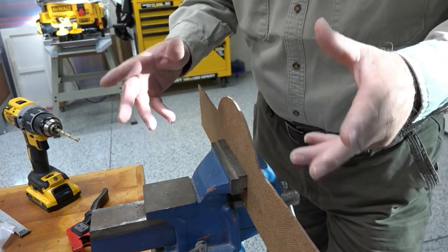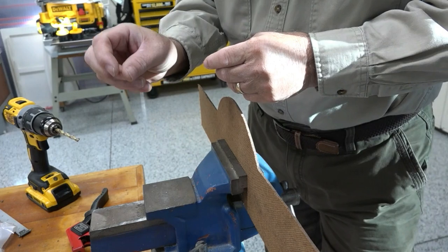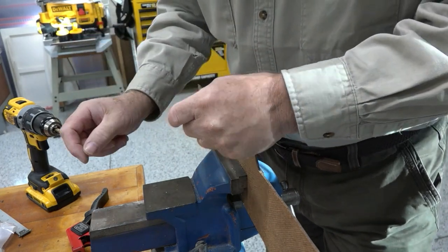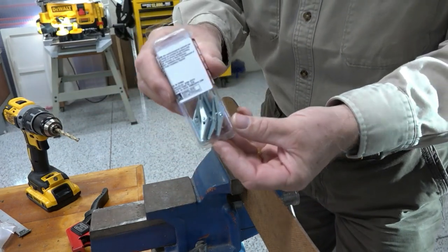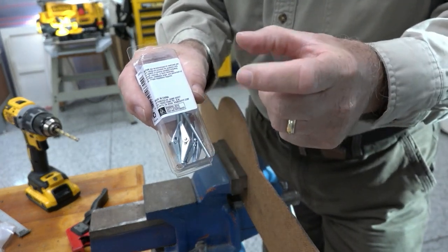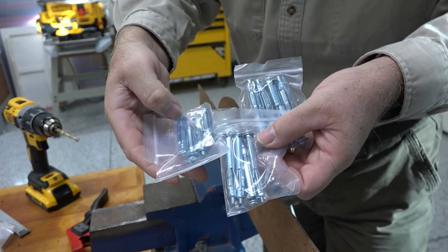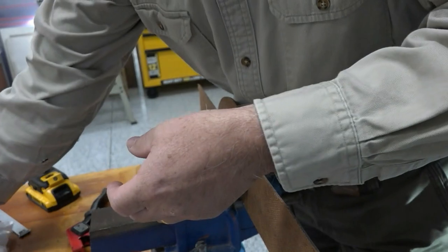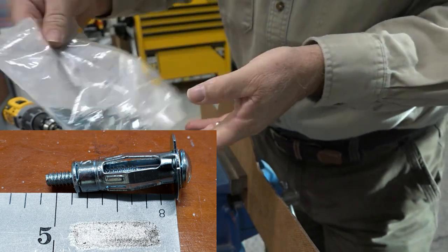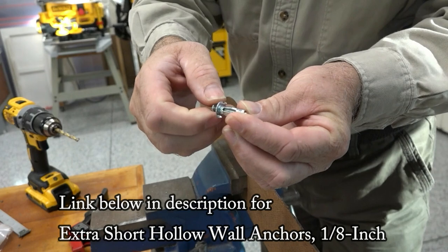To hold the paper towel holder to the wall, I don't want to just put screws in because the wall's only an eighth inch thick. And because I'm mounting it on the outside of my slide room, it's also insulated in there. I originally bought butterfly-style anchors, but you can't use those in this kind of wall because the insulation prevents them from popping open. Instead, I bought hollow wall anchors that are specific for wall thickness — most are for sheetrock, but I found what they call extra short, only an inch long. My wall is just over an inch, and the way it works is you just tighten the screw and it makes the anchor expand.